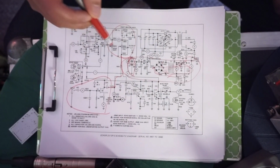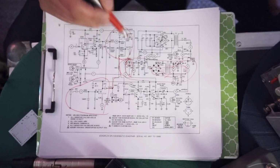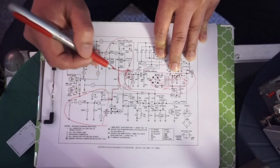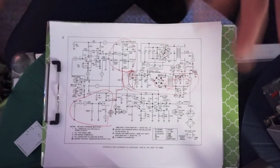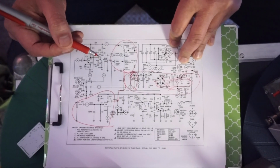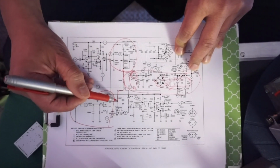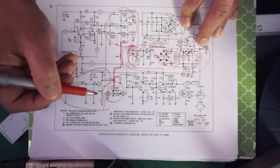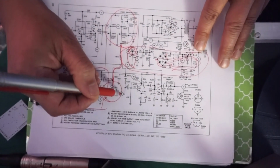what I've done is, instead of using a regular volume control, I'm using the same mixer stage, because when you experiment with the circuit, you realize part of the sound is the way this loads it down. So on the Epoch Pre, we actually have the same mixer stage, but it's mixing between your dry signal and nothing. In place of the delay on the delay pedals, the delay part is replaced by some circuits that mimic the loading that would occur there. Anyway, your preamp amplifies that signal, and your dry signal goes straight to the mixer, but then it also goes down here to the record level pot. And once again, the record level pot on your Belle Epoch Deluxe is identical to this. And then it hits this guy here.